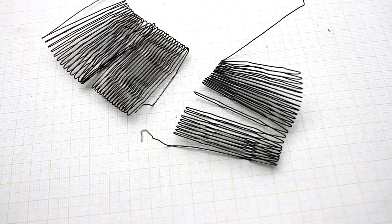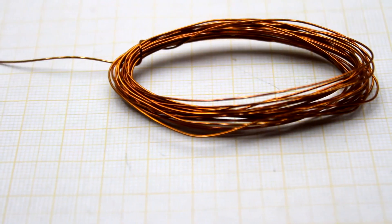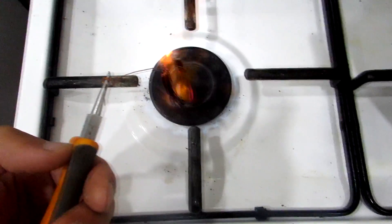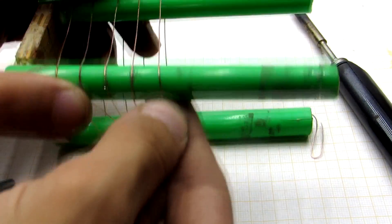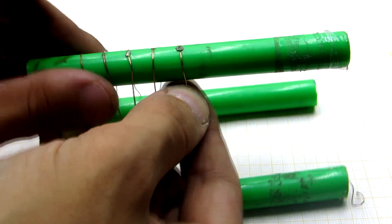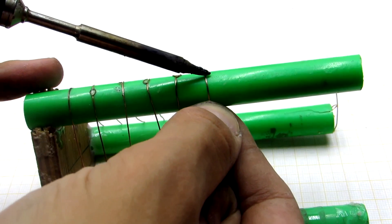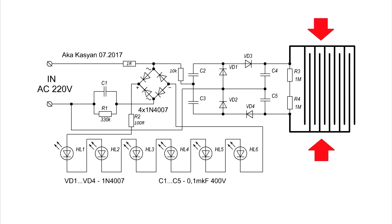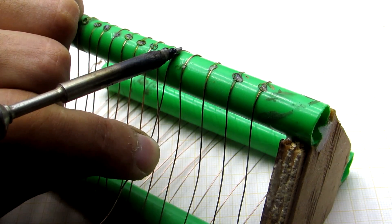Next is the grid making. It can be made from thin Nichrome wire or from copper wire as in my case. The first option is convenient because of rigidity; the second option is more affordable. The wire in my case is single-core, 0.6 mm in diameter. If it is in varnish insulation, the wire must be burned and cleaned. We wind it around the vertical guides and fix it as shown. The grid consists of two parallel conductors — the second conductor must be wound the same way at some distance from the first, with an optimal distance of 2 to 4 mm between conductors.